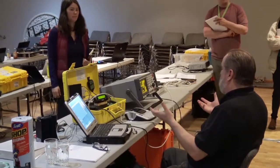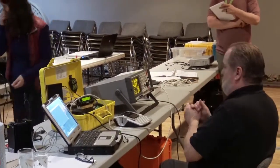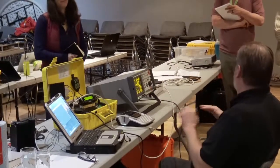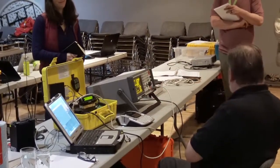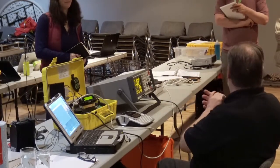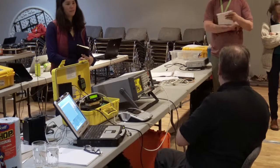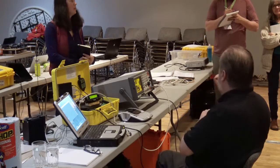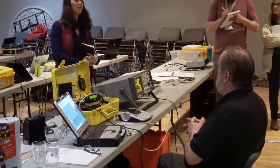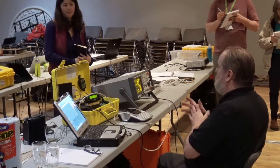Yeah. So basically what we're saying there is, you'll notice everything I have is all Motorola. Well, I worked for a Motorola company for a while, and I learned the Motorola stuff. And these are radios that I'm using that are 30 years old, and they are just flawless. They actually have 12 volts on the little connector on the back. So I feed the 12 volts into the TNC. Does anybody have an idea how much current a TNC draws? Milliwatts. It should be just about 20 milliamps. It draws 14 milliamps until you turn the LEDs off on the front of it, and it drops from that. So it's so efficient, it's almost scary that it runs so low in current. Great for hilltop stuff. I put a 9-volt battery on mine on a little pigtail, and it lasted me over a year.